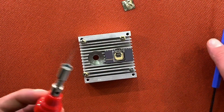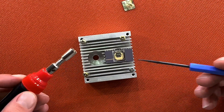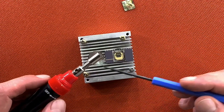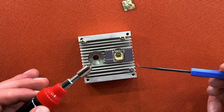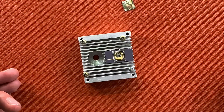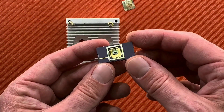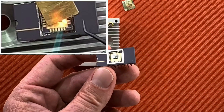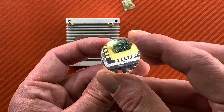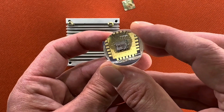You could see what happened — I didn't take care enough. The bond wires were glowing up fully, so I destroyed the bond wires. Unfortunately, the gas torch heats up everything much quicker. Small chips won't crack, but you always have the risk of burning the bond wires and the die with the flame. Now cooled down, we have a nice view to the silicon die, but unfortunately we burned the bond wires on this side. It goes very quickly with the flame — very sad, we damaged it.